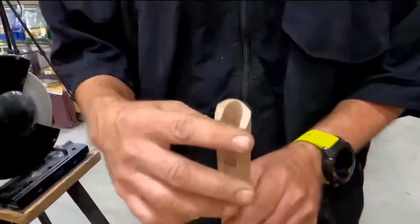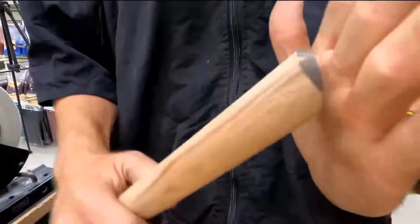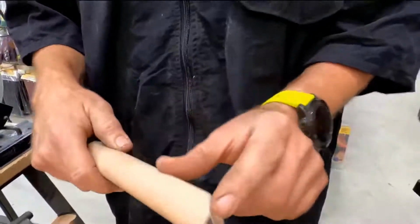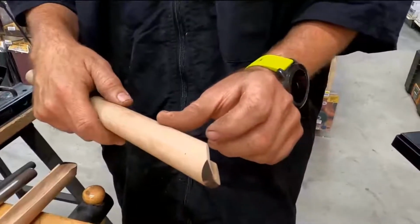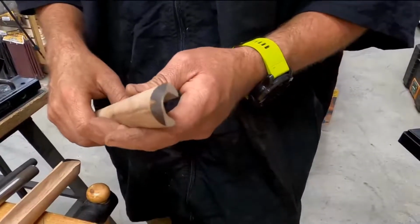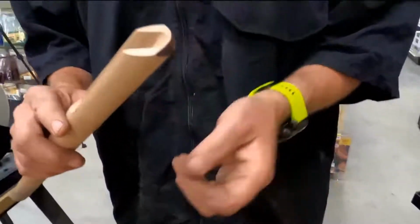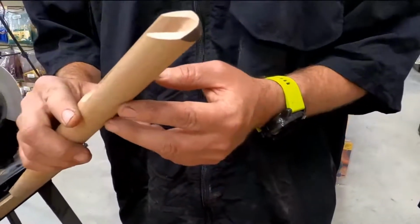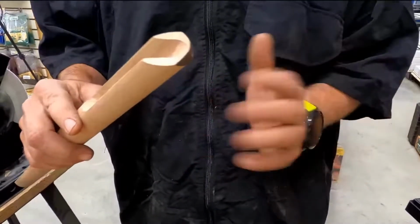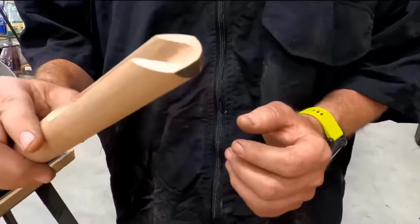The process from getting from this to this will consist of, first, we will grind those ears back. We'll just take it straight up against the grinding wheel like this and go down until we get to the very tip, and then have it swept back as far as we want for our English grind. After we do that, we will set our grinder up at the right angle, which is typically what I tend to use, between 40 and 45 degrees. There's a lot of debate on which is the correct angle, somewhere in between there, but just pick something. Once you get used to it, you'll be happy with it.